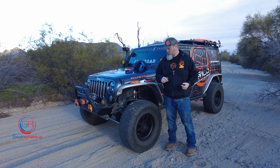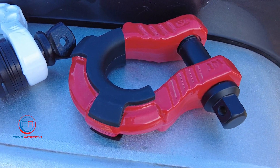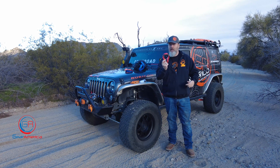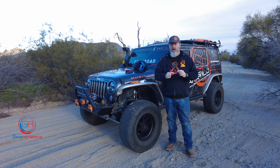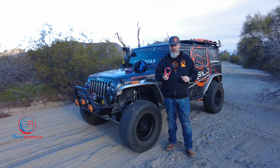Let's take for example our Uber Shackle. This has a 10-ton workload limit — that's the WLL — but it has an over 80,000-pound MBS. When these were put on the big hydraulic machine, we're talking hundreds of thousands of pounds of pressure to destroy these things. The lowest break point on these was over 80,000 pounds.